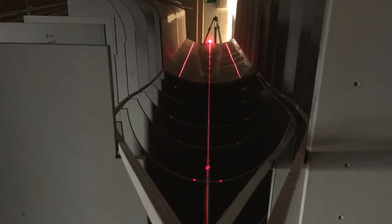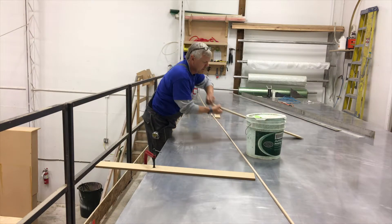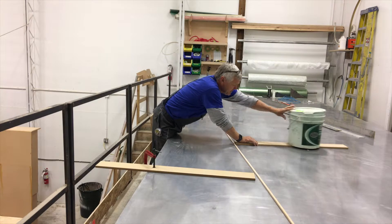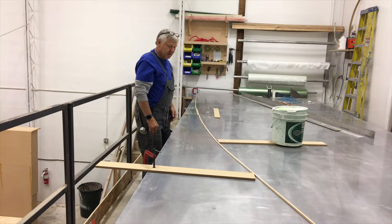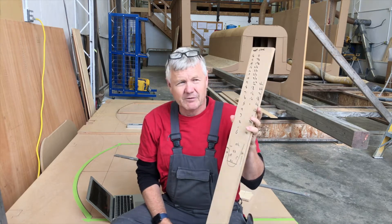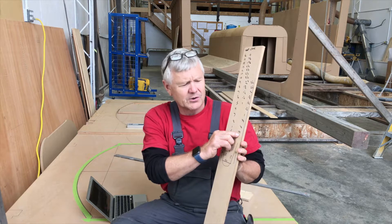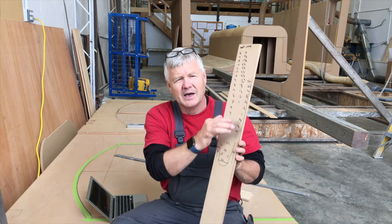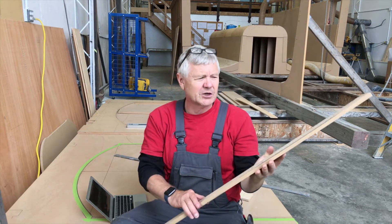What I did — we projected some lines where we've got to come in on the sheer, that 27 inches. I projected a line that I like. Just looked at it and thought, I think I like that line. So then I lofted our projection — that was up on the loft table. Here's my lofting, this is my table of offsets. At zero feet, I've started coming in a quarter inch. At one foot, I started coming in a half inch. So this is my projection of that curve. Crude, very crude, but at least it gives me a good idea.